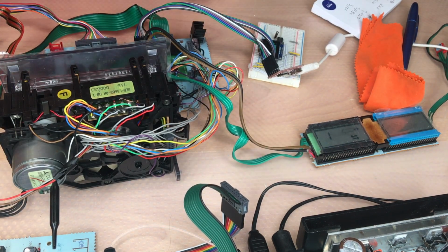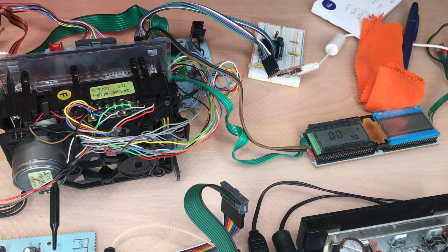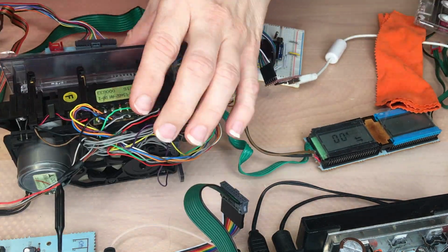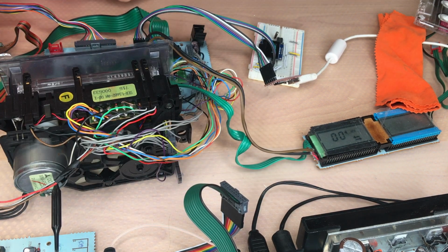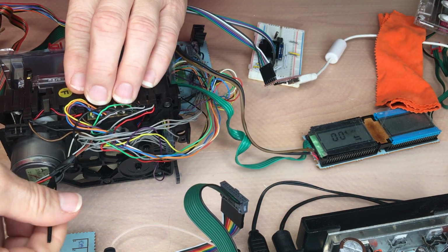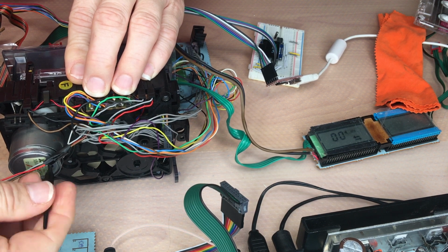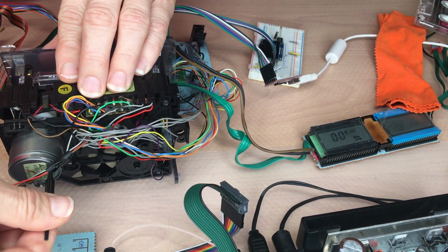To change the speed on a capstan, there's a small potentiometer on the rear side. Trust me, it will drive you crazy. Only a little bit of movement will have a dramatic change in the speed, so this will take some time.